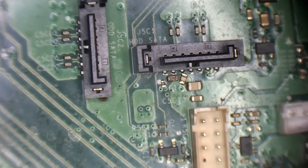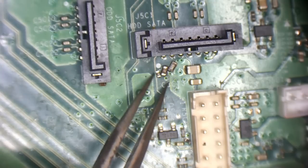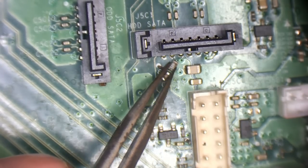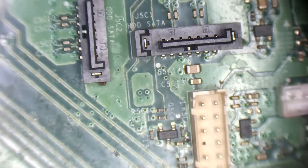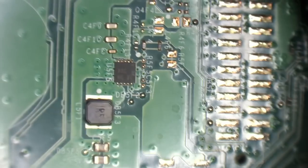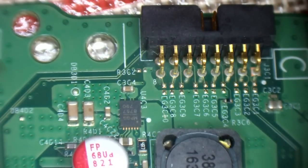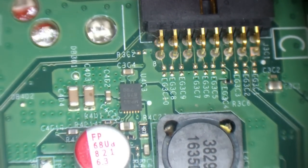Oh, I'm going to give this a quick scan just to see if there's any more liquid damage. Oh look, I found a fuse. Where's this from? Nah, that's just crap that's pinged off, that is. I think I definitely need to ultrasonic this board before it gets sent. All them caps and resistors are pinged off the board. That's an area that always gets liquid damaged. Well, not always, because it's only been done this time. They'll ping off when I ultrasonic it. Be all right.